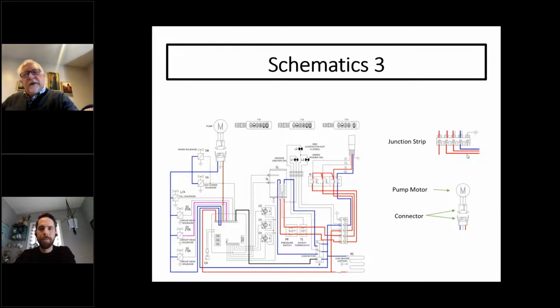The only exception in the U.S. is on old dryer outlets in older construction, where they would actually have the ground and the neutral together. Back in the circuit breaker panel, they're actually connected.